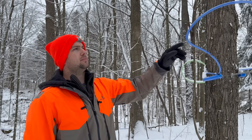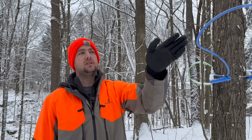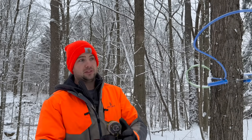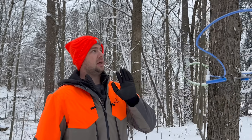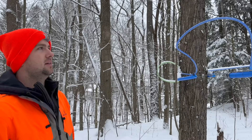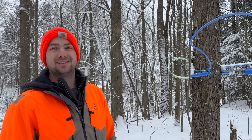We run our one-inch lines every 75 feet, so you're just not going to have that many taps on one. We want our one-inch main lines no more than 100 feet apart — we shoot for 75 feet. That way you use less 5/16ths line and you get straighter runs, with only about five taps on each 5/16ths line. If your main lines are 150 feet apart, you could end up with 10 to 15 taps on just one 5/16ths line. And it makes it way easier for tapping — you feel like you're getting something done when there's fewer taps on the line.